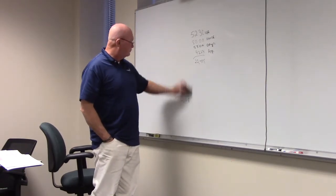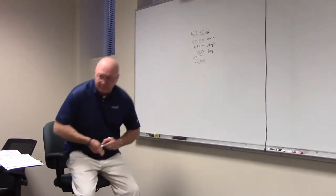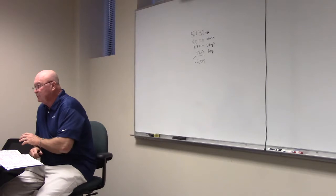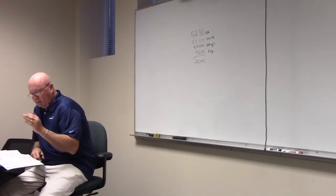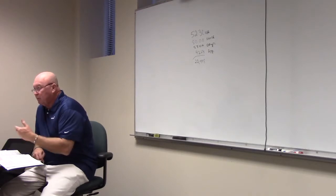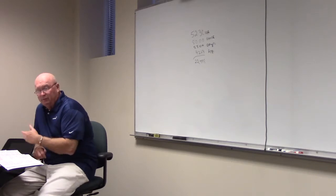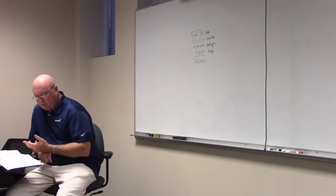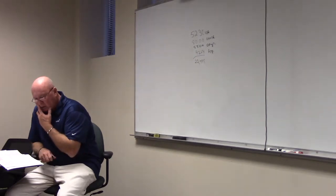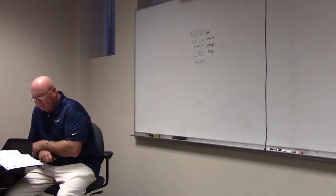Is that right? Mm-hmm. All right, so we're there. So we're there now on step 7 on page 20. That's where we're at. Step 8, we got to do one more thing. It says we have to take, because of our largest motor, we have to do it by 125%. So we got to find out which one was our largest motor. We can go back and look at the volt amps and see which one that was. Okay. The largest motor is a 1656 VA.